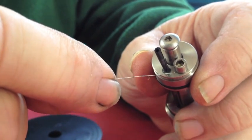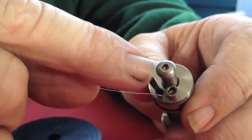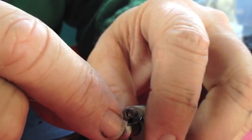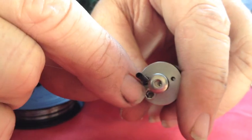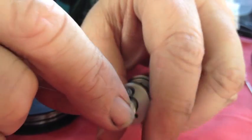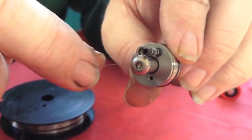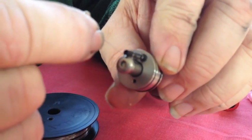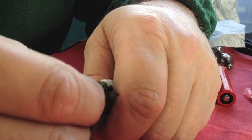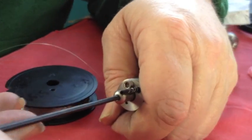Now if you take a close look here, I'm going to come around the outside — not the inside, but the actual outside of the wick. And I'm not pulling hard on the wire. I'm just guiding it around until I've got my four wraps. You'll see that the wire naturally wants to come out this way and around this side of the screw. This will drive electricians crazy because you never normally put a wire counter to the direction of the screw, but in this case it really does work best.